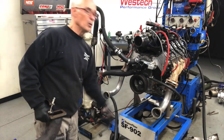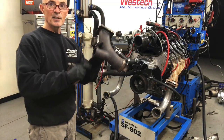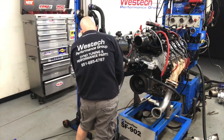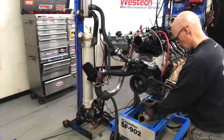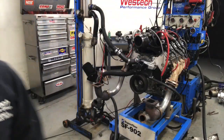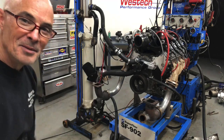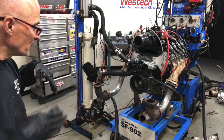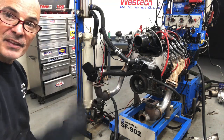So we've got our two elbows mounted. We'll put our turbo elbow mounts on for our race setups and see - it's not exactly Nelson Racing symmetrical, but they're close enough. All we've got to do is mount the turbos on there, see if the exhaust works out, get the wastegates mounted, and then we can work on the intercooler.